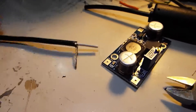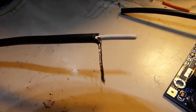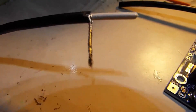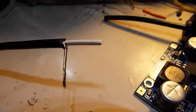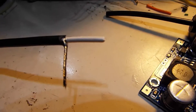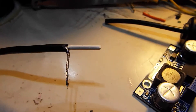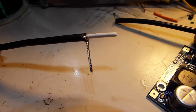I've cut the end of the cable off from the connector and stripped back the insulation on the outside, just wrapping the outer sleeve of the cable around. This is the ground side of the cable, and then the white section I'll strip off — that'll be the positive output of the power supply. If you're unsure, you can always hook up the power supply after you've stripped the connection back and just measure it. You should be reading a positive voltage on the white in relationship to the outer jacket, which should be the ground.